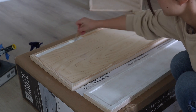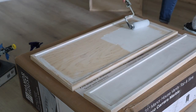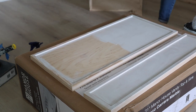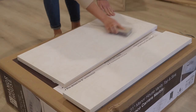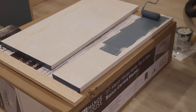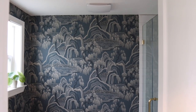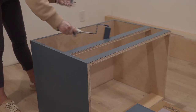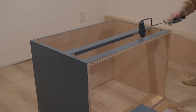I first use a brush to go over the corners and then use a roller to apply the primer. Once the primer has dried I give a light sand and then apply two coats of cabinet grade paint. I chose a blue color to match the wallpaper of the room — the color is called Benjamin Moore Spellbound. At this point I'm also painting the vanity frame including those small ledges that can be seen when opening the drawer.